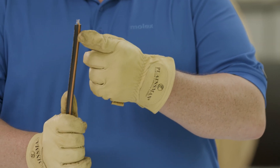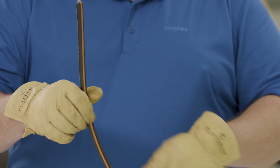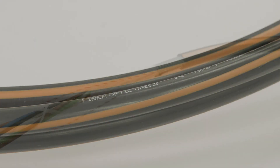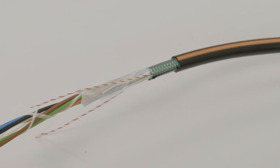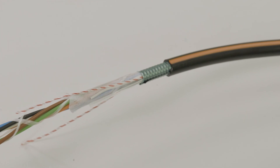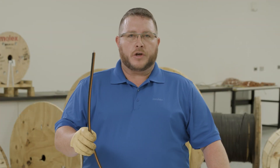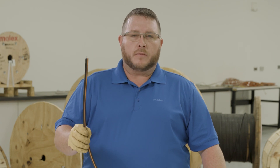As you can see, we added an orange stripe to the exterior of this cable. We did this for multiple reasons. First is ready identification. The second reason is if there are multiple operators in your area, how do you identify in an excavation which cable is yours? And last but not least, when your cable is found during an excavation, the orange stripe allows your customer service representatives to rapidly understand if it's your cable and an active cable.